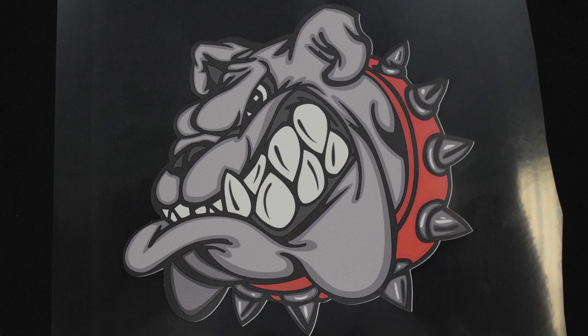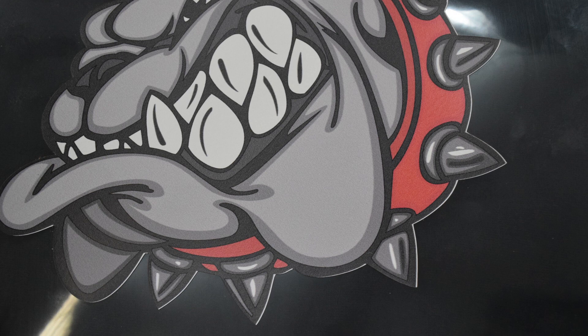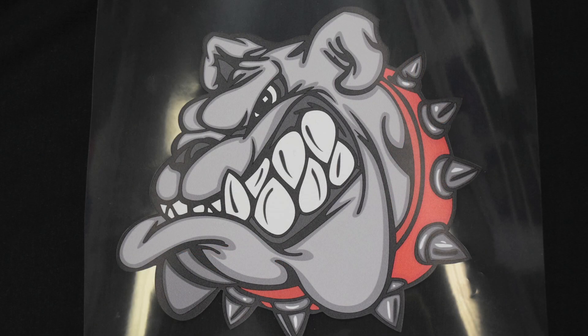This image of the Bulldog used just a standard cut contour line with no bleed zone. As you can see, after cutting for a while the image has a white border that wasn't in the artwork — this is due to the cutter getting offset. This other image used the bleed zone, and now it looks like just the normal black outline from our design, because the bleed zone compensates for the inaccuracy of the cutter over time.